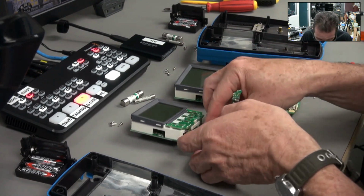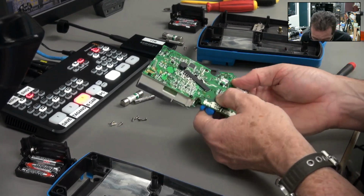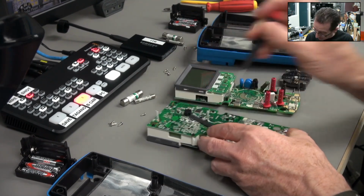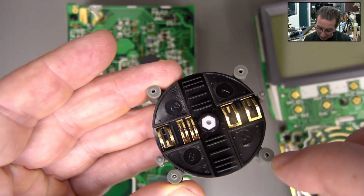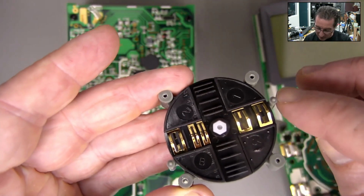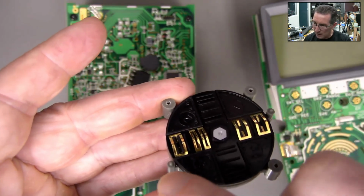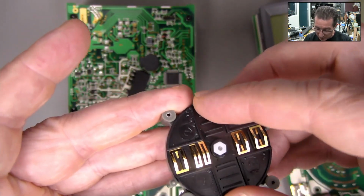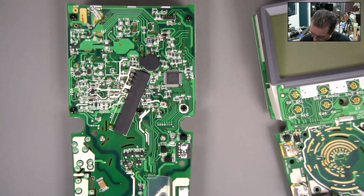As I said, multimeter switches are generally pretty good at self-wiping because they've got that contact pressure coming down, so that shouldn't be a problem. Although the interesting thing, looking at this switch mechanism here, is it could be a height thing. Maybe even the standoff. If any of these are slightly higher, or even these supports here, although that's overcome by the screws, I guess. Or the thickness is slightly out. There's not really much else that can go wrong.